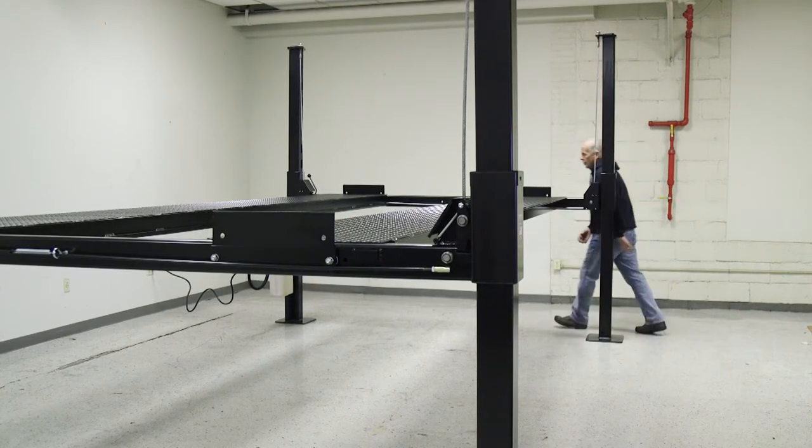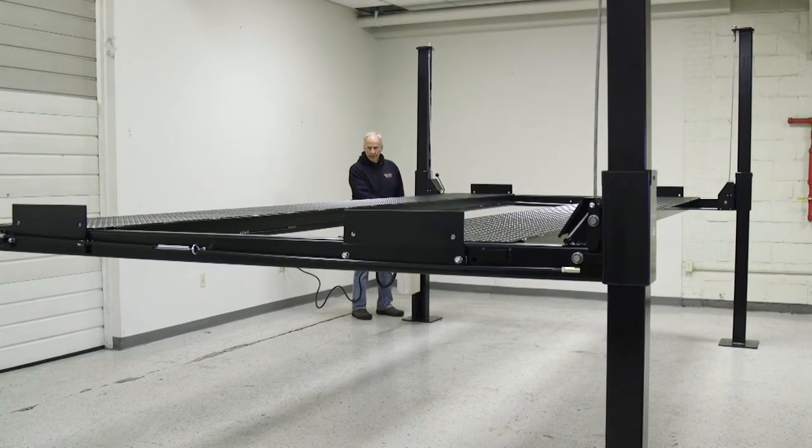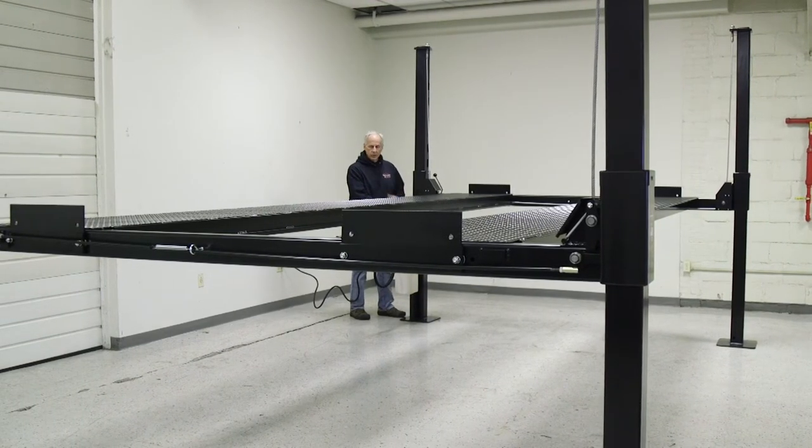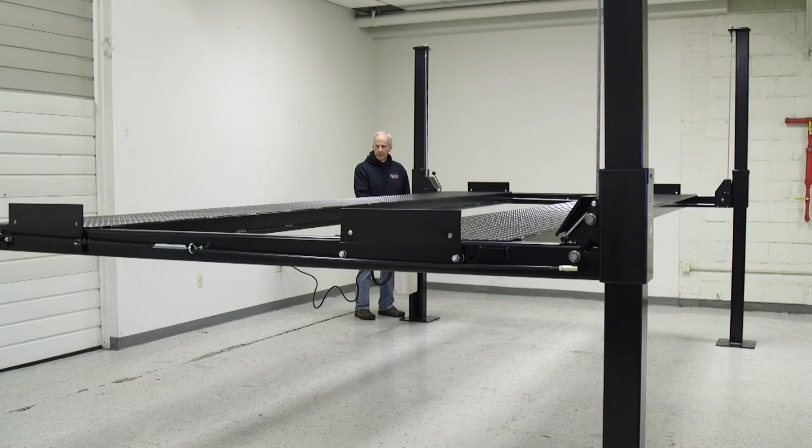Around the secondary lock and the pulley — and we are good to go. So now I'll continue filling this up. The next thing you're going to see, it's going to get tight, it's going to raise the lift off of the locks. And then we're going to let it down to bleed the air out of the system. And here it comes — we have lift-off.